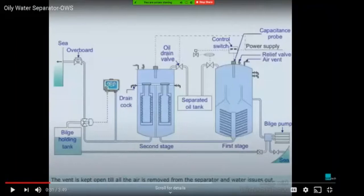And apart from this, cleaning is usually done prior to circulating the seawater. That basically cleans the entire system. Whatever oil or grease-like substances are present are flushed out when we use the seawater initially to completely fill the entire system.